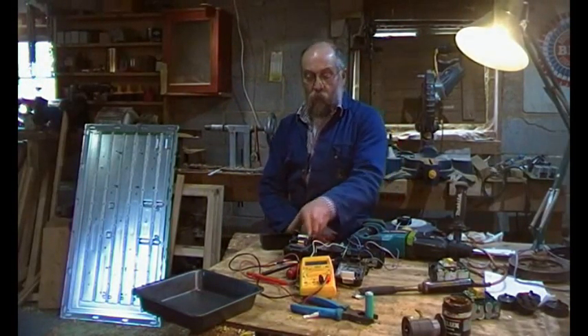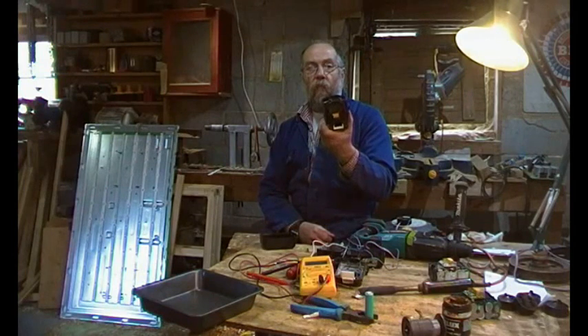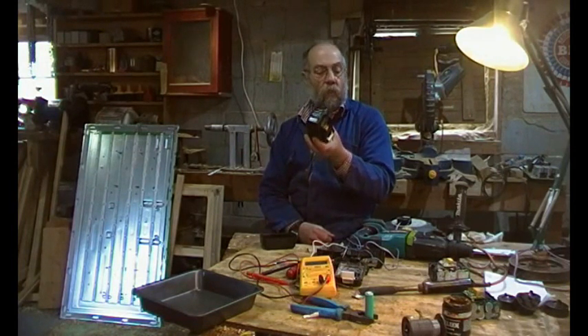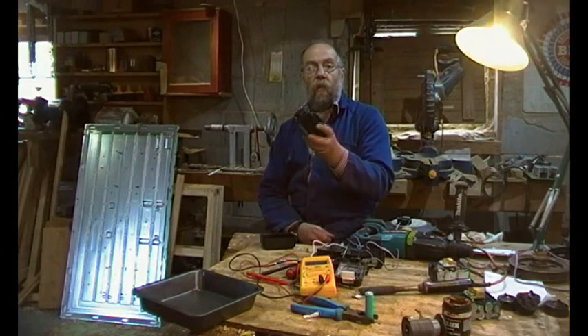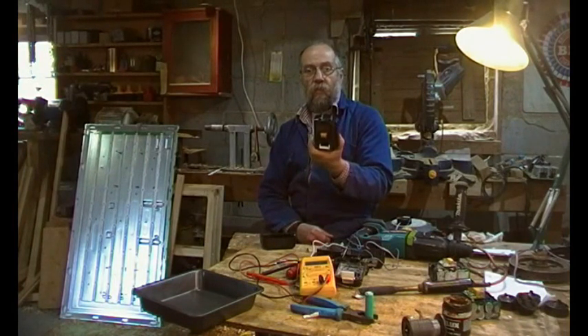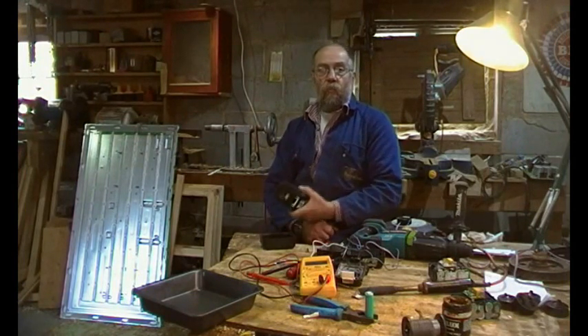Hopefully that's inspired you. If you've got several of these lithium batteries you can make one good one out of two. It takes a while but it's a little bit of effort. Leave it on the bench power supply for eight hours — nothing's going to go bad because it's limited voltage and current. If you get a good one, brilliant. And the key is: don't over-discharge it. Once the drill starts to slow down a bit, stop. Hopefully you found this useful — catch up with you soon.